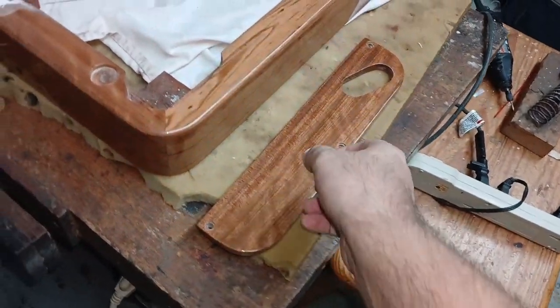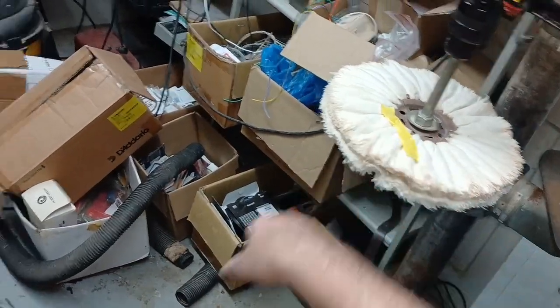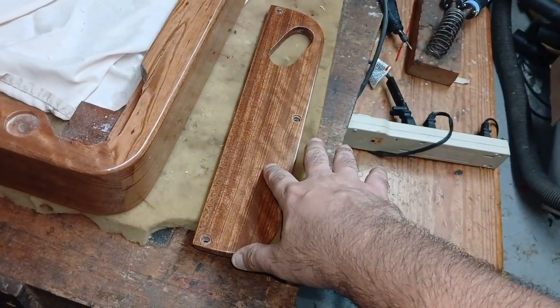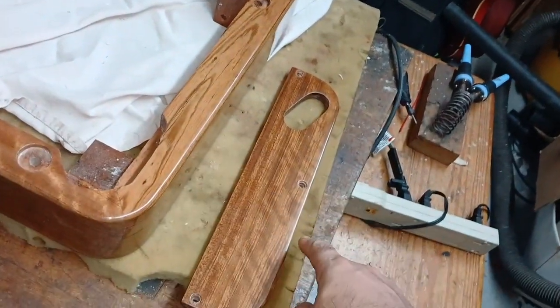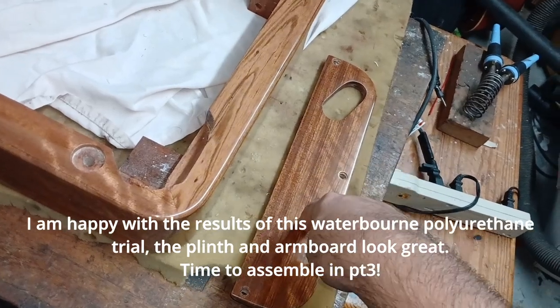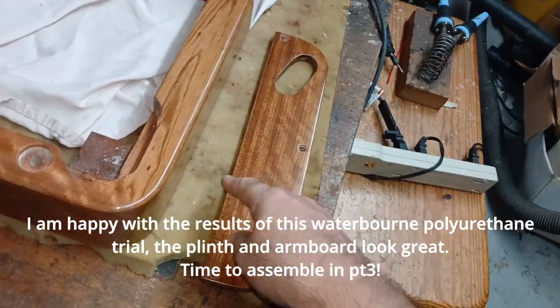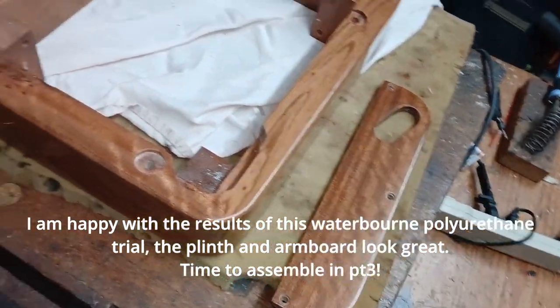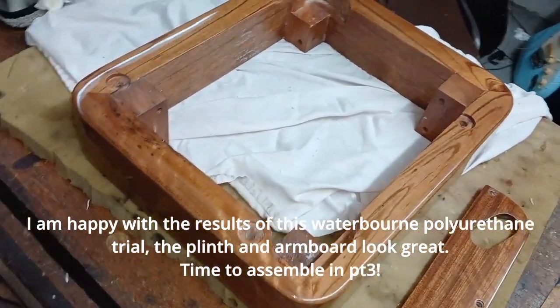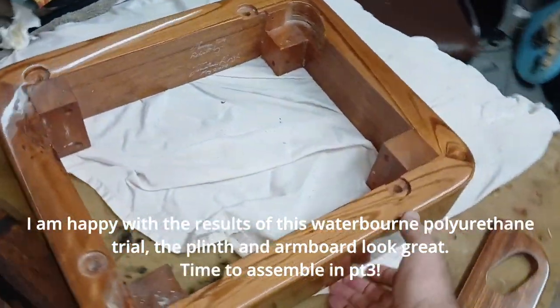Yeah, one of the things is that when I'm buffing it, I could still see real tiny scratches in the finish left over from wet sanding. And normally you would buff your way through that. You would say, okay, well, I could buff out those fine scratches without going back to the fine wet sanding. But you see, again, I don't know this finish as well as I know nitrocellulose. So I didn't know, do I go back to the wet sanding or do I continue to buff and get the problems out? So it's one of those little sitting on the fence kind of things while working.